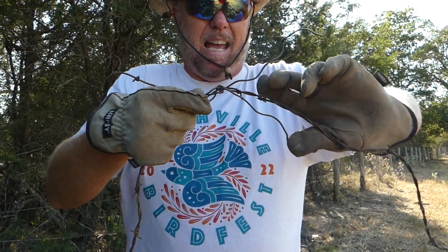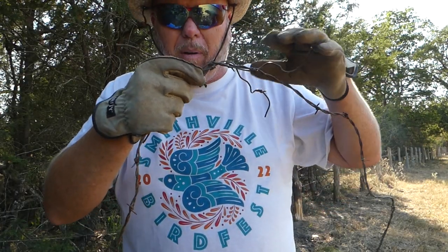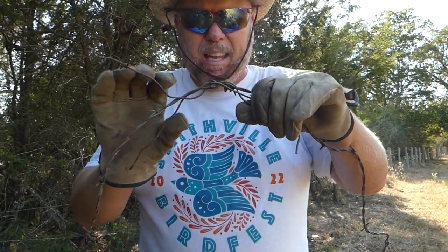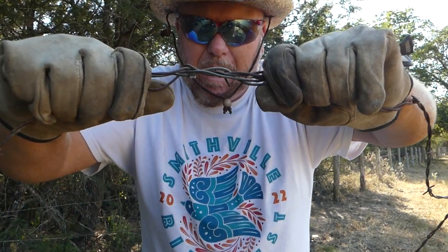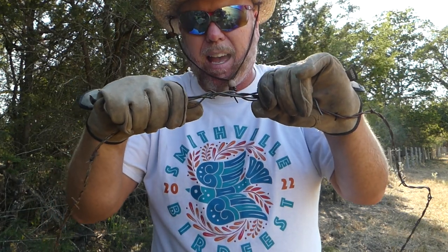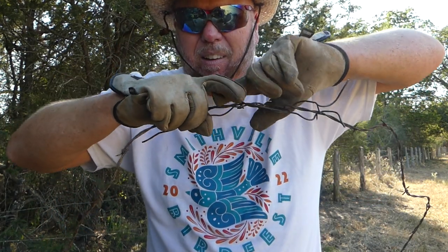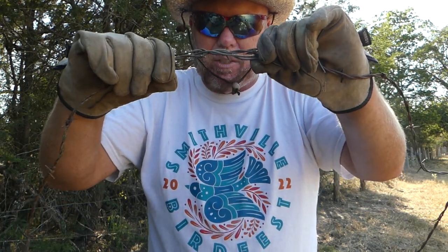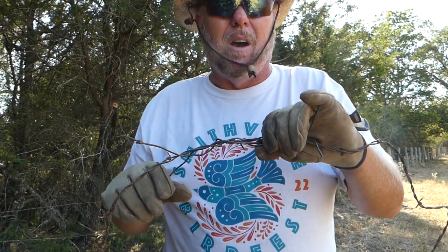You do it on this side as well. Now I'm going to use this piece of barbed wire here for patching, so I'm not going to go all the way, but you get the point. You see that there's not a hoop — that is woven into one piece of barbed wire. Now I can pull that, I can stretch that, and it'll just get tighter, instead of the loops getting a kink in the middle and cutting each other. This just acts like one strand of barbed wire. Let me go ahead and do it in practical use so you all can see it.